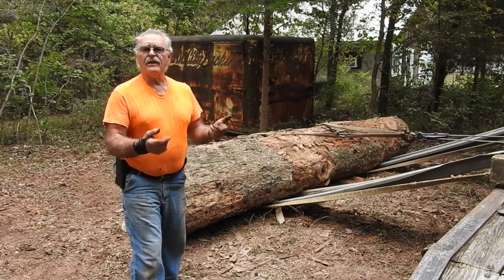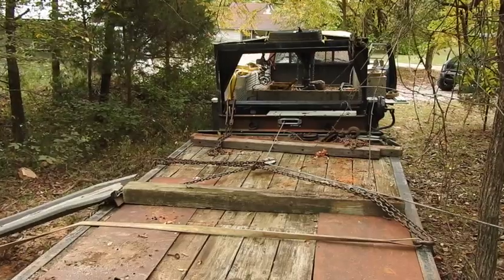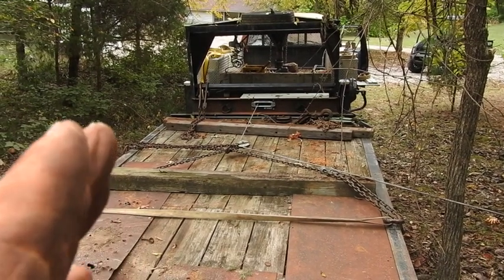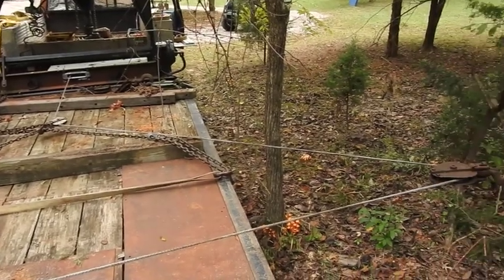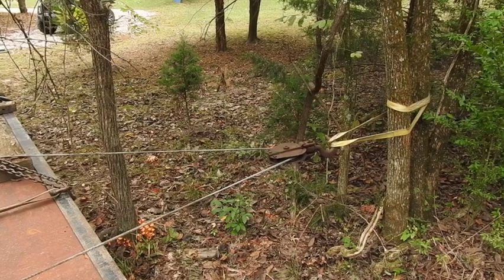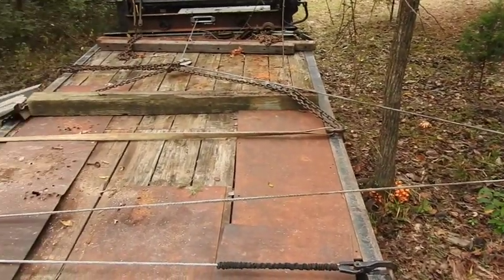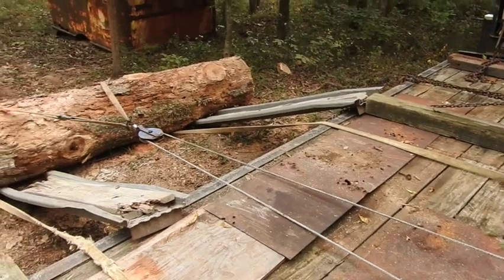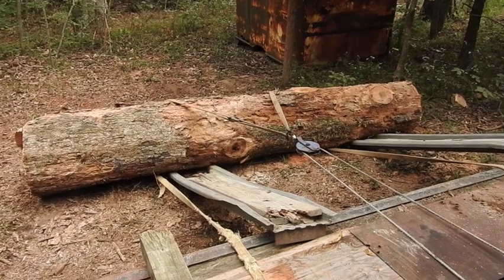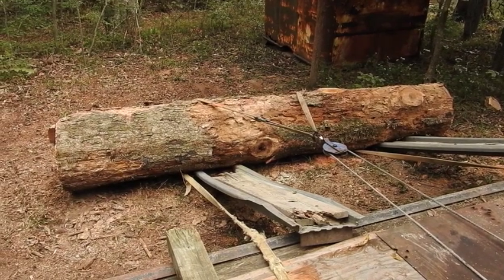This is kind of a deja vu all over again because this is the way we loaded those big logs up in St. Louis last year or the year before. So we're back again with the same old setup. There's the Badlands 12,000-pound winch with the synthetic rope. We've got the snatch block in the dead center of the trailer to pull straight into the fair lead, and then over here on this tree, about 4 and a half to 5 feet off the trailer's side, we gain a little bit of distance on our rope by having that snatch block off to the side of the trailer. If you just follow the cable down, we've got another snatch block to double our output of our winch right there on the actual log. The nylon chokers are wrapped around the log in a V-pattern and attached to my side of the trailer.